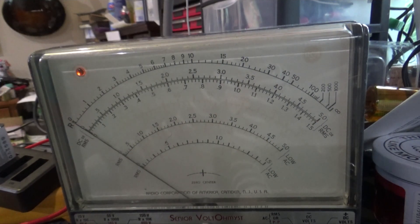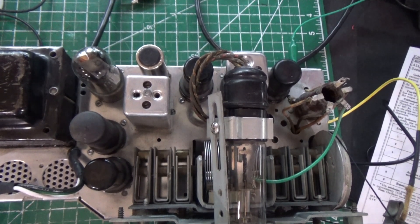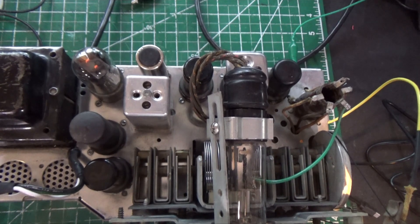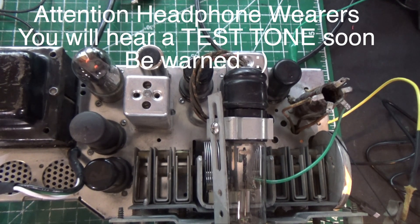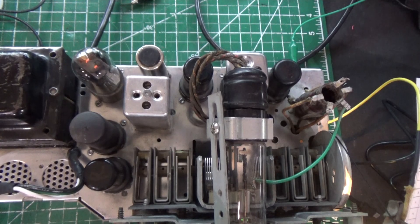With the meter connected directly to the voice coil of the speaker, a couple of rules before we get started: you don't want a blaring signal coming out of the radio because you'll trip the AVC circuit and won't get an accurate reading. You want just enough sound to hear the tone coming from the signal generator. The radio is powered up, tubes are starting to glow. Step one and two: put the high side of the signal generator to the antenna terminal — done. Tune to 455 — done. Turn the radio dial to the A band, broadcast, to a quiet point between 550 and 750. We'll go right to 600.